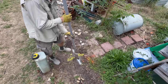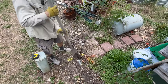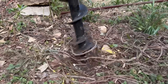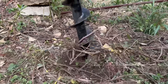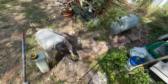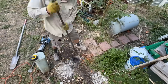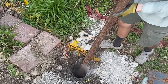With each post hole marked it was time to dig some holes. For a six-foot tall fence the goal was to dig at least two feet deep. In my region the soil is full of limestone boulders — sometimes as big as beach balls. If you encounter one with an auger bit it sends the bit careening off at an angle. So while I tried to use the power of diesel whenever I could, I sometimes had to resort to a sharpshooter shovel and a jackhammer. Eventually I got all my holes dug, though on occasion the boulders forced me slightly off perfect ten-foot centers.